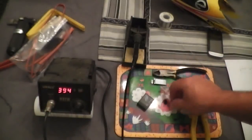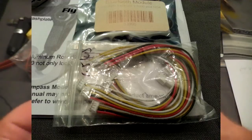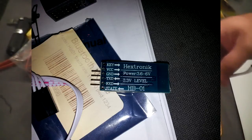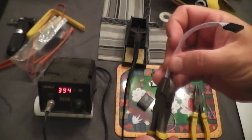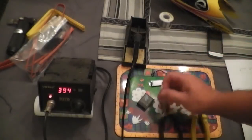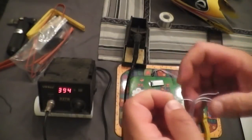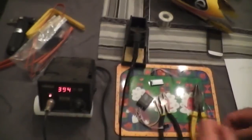So what we've got to do is — I've got this little Bluetooth module here. It came with a little 4-wire cable. What I'm going to do is cut it off about halfway along, strip these wires back, and basically solder them to this cable here. This is where you've got to make sure that your pin-out is correct. I'm going to heat shrink these once I've got it all done, but I'm going to put the heat shrink on now to slide over the whole lot later.